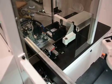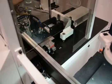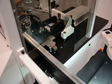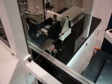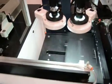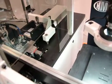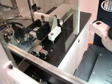HMI also sells dedicated cassette loaders: one which will only load the substrate onto the printer, and another dedicated one we call the reloader, which will only reload parts into magazines. Typically, a system would have a cassette loader, a printer, a dryer, and then a reloader, where the parts are printed, dried, and reloaded. In this application, the printed parts are put back into the cassette with the wet print on them, and that cassette is carried over to another room or area where it can be hung onto a separate machine to load your dryer or oven.